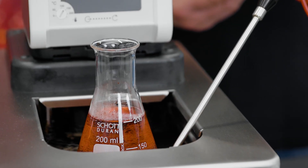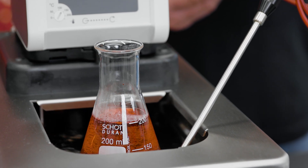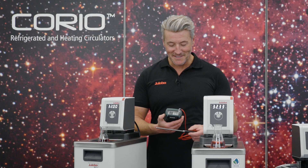Again we need an external temperature sensor to check the defined point inside the bath. We wait a few seconds and the temperature sensor shows a temperature of 32.01 degrees Celsius, so we need to compensate the difference of 0.01 degrees Celsius.